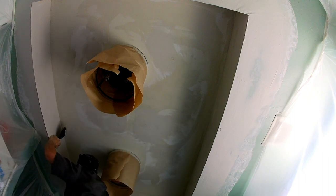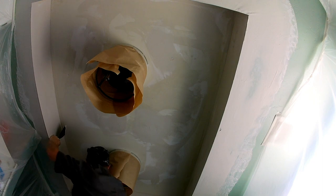You have to slick out hot muds no matter what. They have to be slicked out. You can't just put this on and let it dry overnight or you'll be in trouble. You have to work with it as it's setting up. Don't put it on and walk away from the job. You have to slick it out at least before you call it a day on the job.